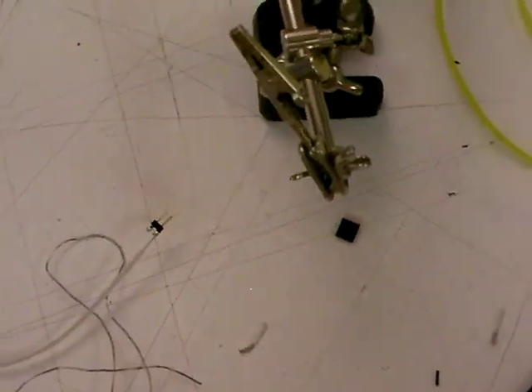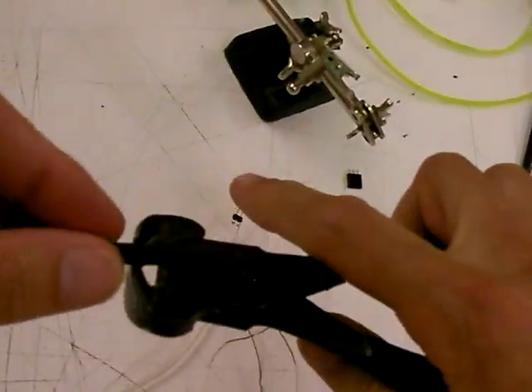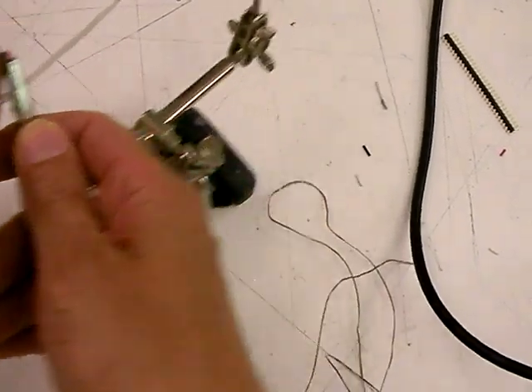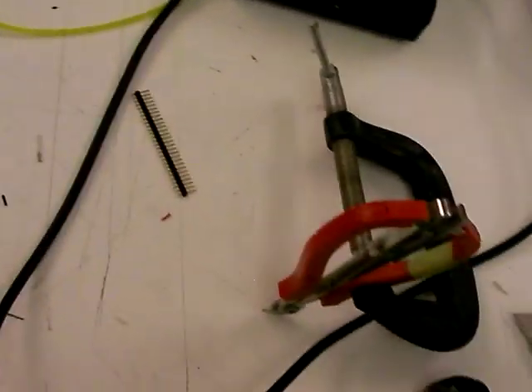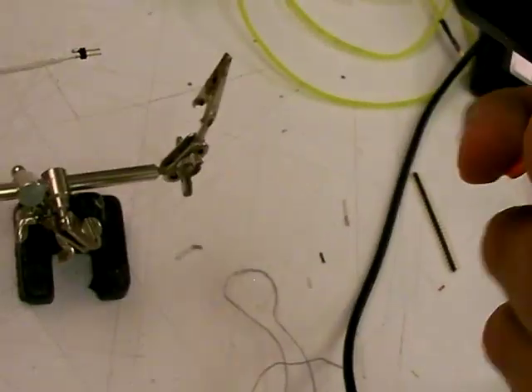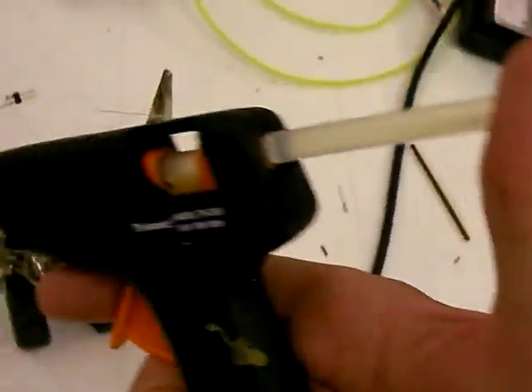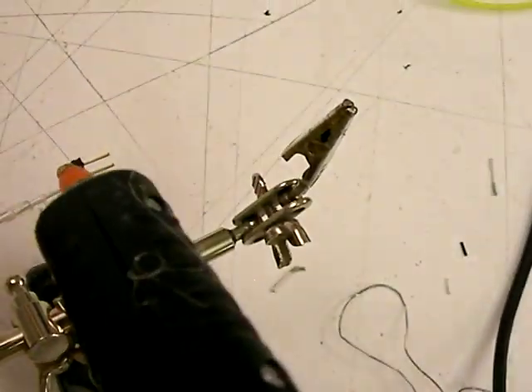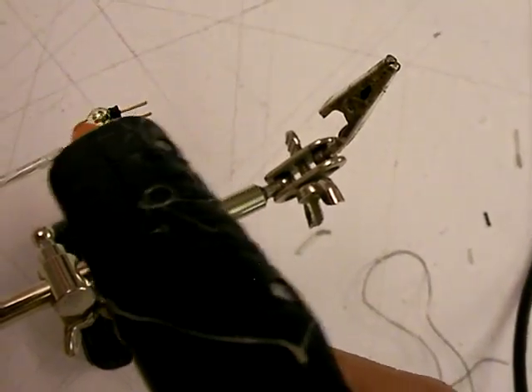This is what makes these joints fairly robust in the face of quite difficult conditions. Find yourself some heat shrink that's a little bigger than the joint you're trying to do. What you want to do is take some hot melt glue — I use the cheapest hot melt glue I can find, I get these from dollar stores — and just put a big old blob of hot melt glue in there. Keep it away from the contacts.